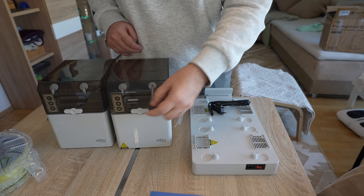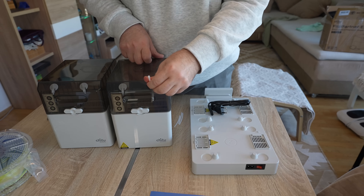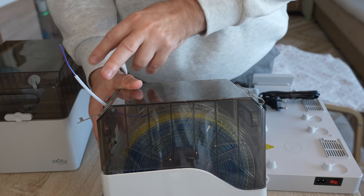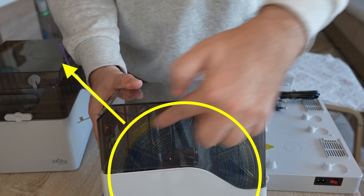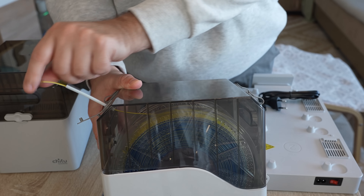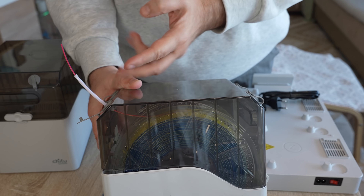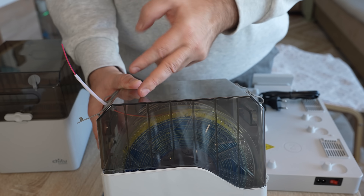The PTFE tubes need to be placed at the filament exit to reduce friction between the filament and the rubber element. I don't like this exit angle — it's perpendicular to the surface rather than tangential. However, since it can be used in both directions and there is some distance for bending, this increases friction only a little — especially with carbon fiber filaments.